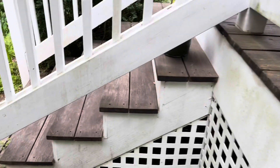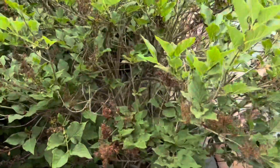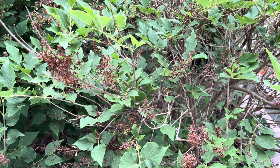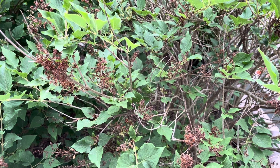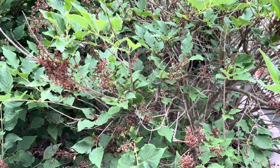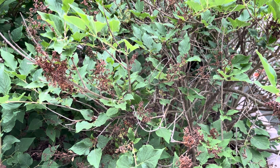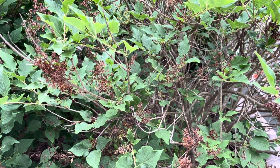It's almost empty. You're low on refrigerant. You could do nothing — which isn't why you called me. You can add refrigerant with no warranty and hope it doesn't leak out. It's expensive — it's $350 for the first pound and $200 for each additional pound. It's R22, an old system. I can't see it taking more than four or five pounds based on the data plate.